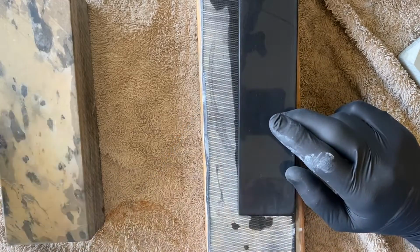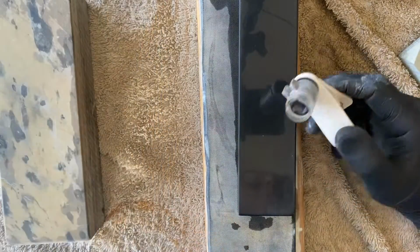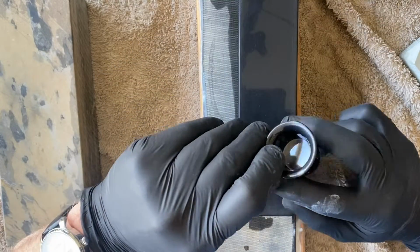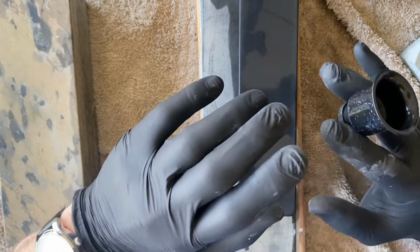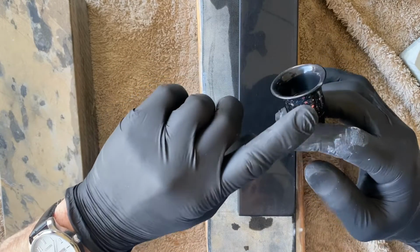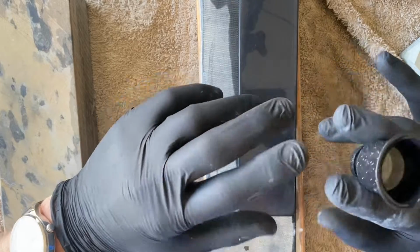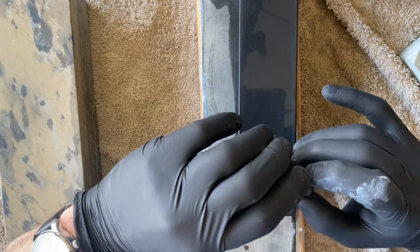The other thing is to have some kind of magnification. A loupe like this, or maybe one you can just clip on a phone. You don't need to spend a fortune, but you want to at least have some kind of check on the low-end quality of the edge. And that's why I say low-end. You don't need to buy a fancy microscope. You just want to see what you can't see with your eye to some extent, so that you can understand if you're making progress or not.